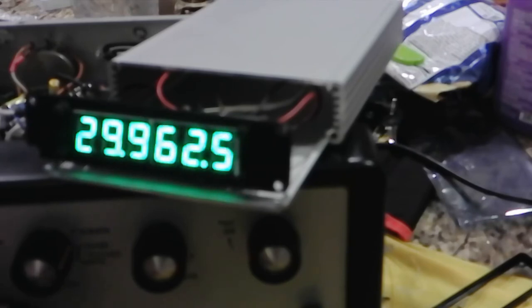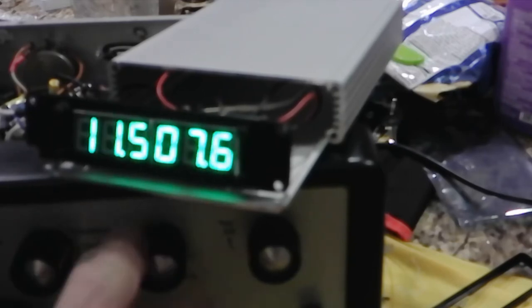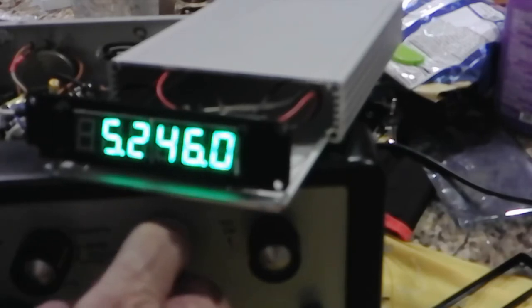So look, we're up to 31 megahertz. No problem. A little bit of instability there, but not much. It settles down. Look at this. This is band 3. Now this is going to have to be realigned, wrong way, upside down, backwards. 1590, okay. Stable all the way through. So basically, throughout all four bands, the oscillator is adding 455 and we're subtracting it out.